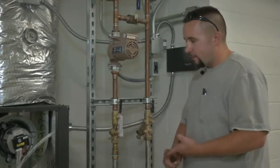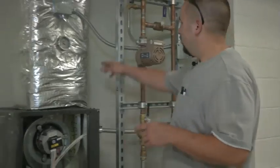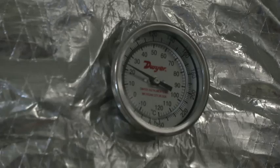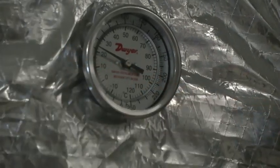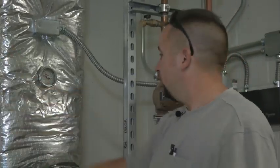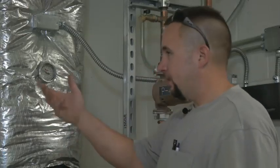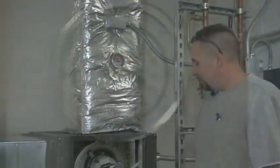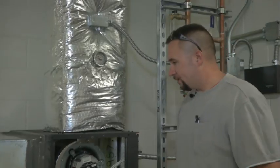As long as you've got good water flow and good airflow and everything's running properly, there's not a lot you have to do. It looks like in this case they put thermometers in the supply and return air — that's a good thing, you can check what kind of delta T you've got across the coil. If you've got a really hot room you may be bringing back 80 to 85 degree return air, and you'd like to see at least around a 20 degree drop across the coil. It all depends on the conditions of the space you're trying to heat or cool. These units are running off the building automation, so they'll run as the BAS system says they need to.